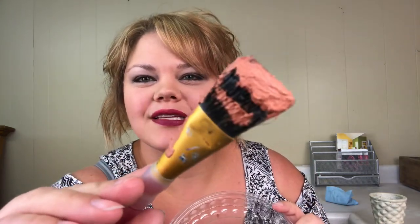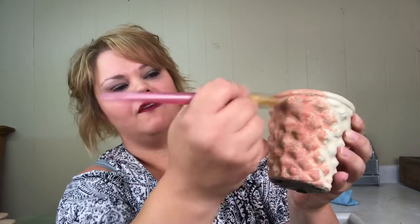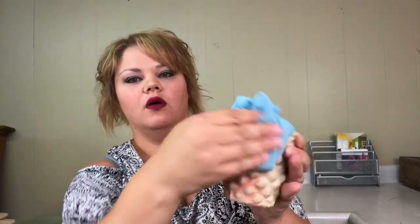You can see we have a wax texture. I just mixed some in there. Then I will take my piece — you do it with a rag, but I got this brush all dirty, so I'm going to try to work it into your crevices. These are pretty big crevices on this project, but say you had something with smaller details, it might show up a little bit better. We got a good chunk of it with wax everywhere. Then you take a lint-free cloth or an old t-shirt — I use the blue shop towels — and you just wipe the wax back off. By doing that you'll get your colored wax to kind of stay in the crevices and in the divots.